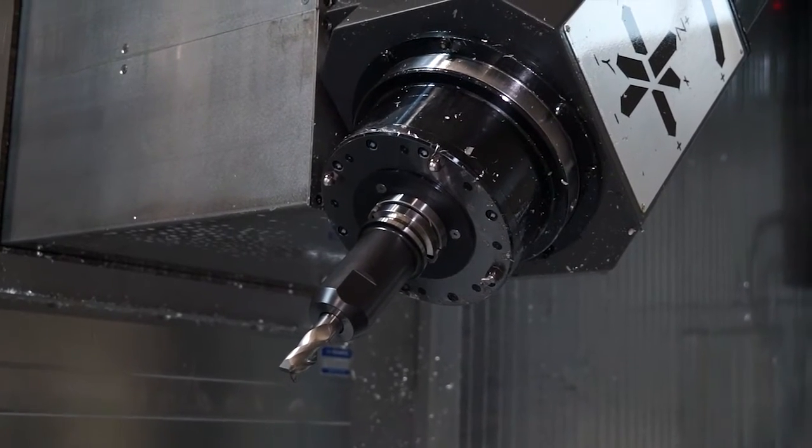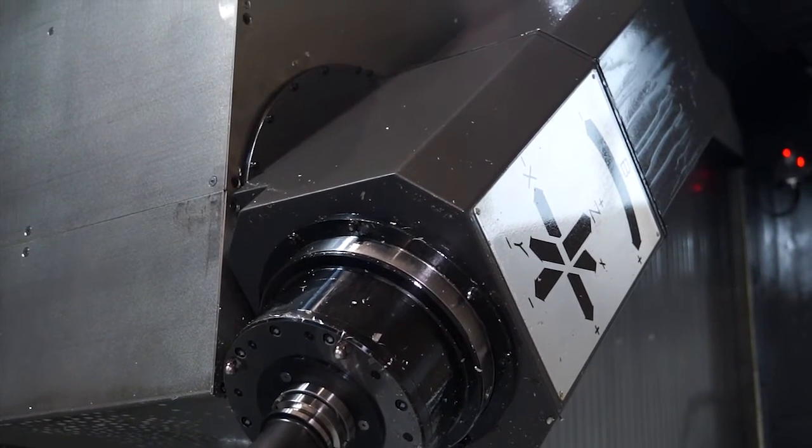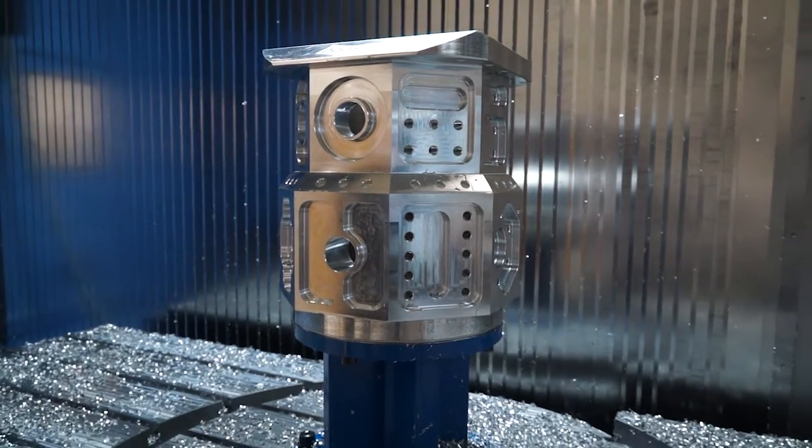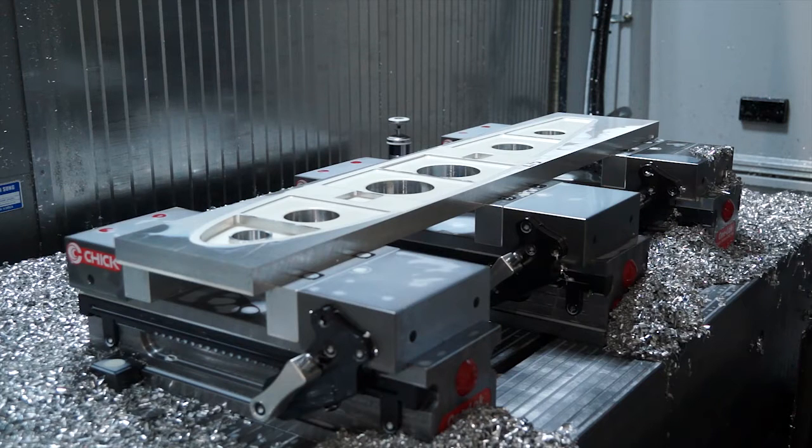It's the LSR — so what does LSR stand for? The standard machine is a two-meter bed length. The L is long bed, so this is the long bed version. S basically means swivel head — this has 220 degrees of swivel movement, it's a full contouring head. The R is rotary table. This has the built-in 800mm diameter rotary table, or you can have the separate 500mm table which can be mounted as a fourth-axis unit or laid on its back in the same plane as a 500mm diameter.